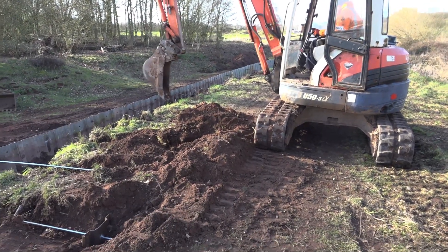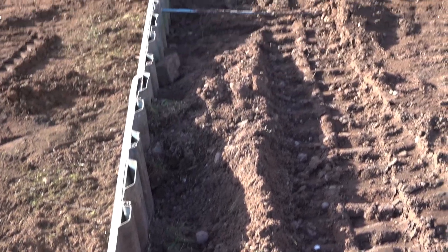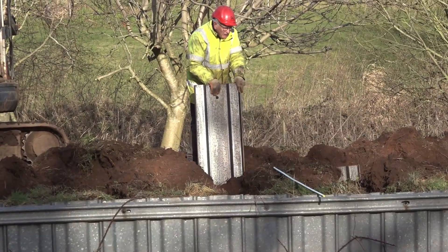What we're now doing is making sure that the soil pressure is naturally supported by the ties. It's not reliant on the water on the opposite side, which we haven't yet got. So we're gently digging out on the one side, scraping a trench, putting an anchor pile at the back, and then adding three-meter-long tie rods.